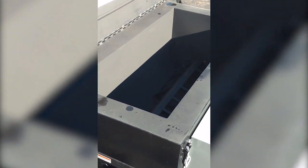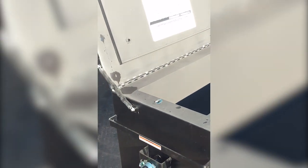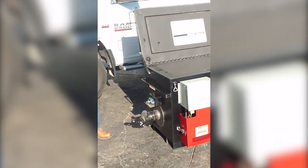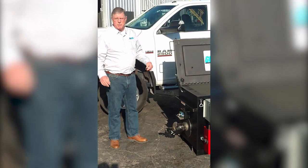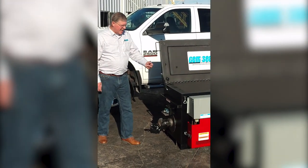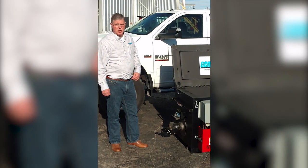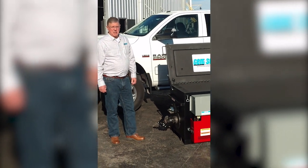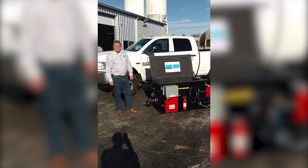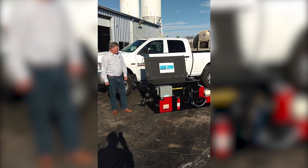Beyond the hot irons, various drag boxes allow you to strike the repair off at different widths — 12, 18, or 24 inches wide. The equipment is thermostatically controlled and very easy to use. The 200-gallon trailer unit is essentially a one-switch machine: you flip it, it heats up, agitates, and dispenses material out the back for larger repair jobs.